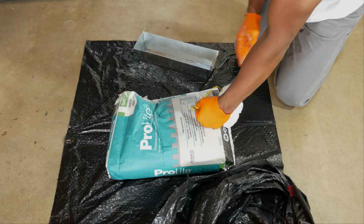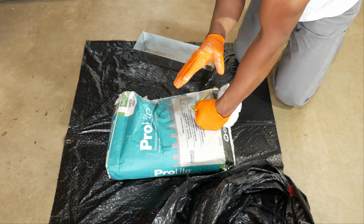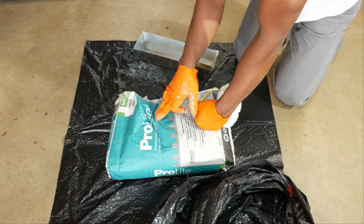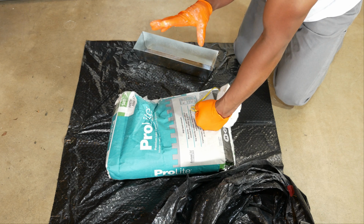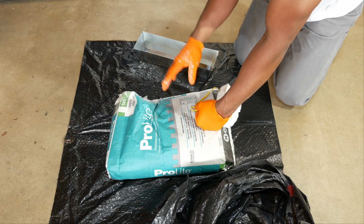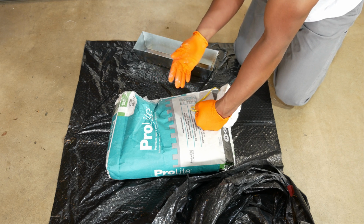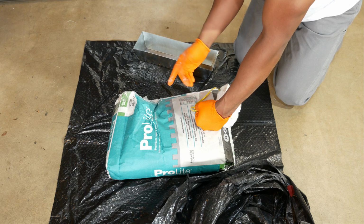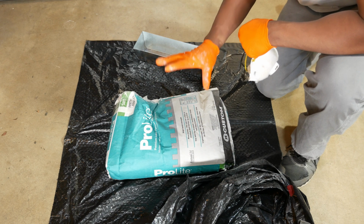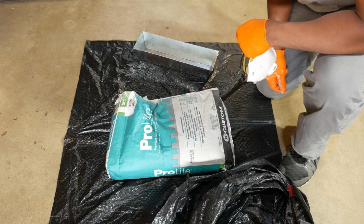Alright, so I'm out here in the garage. I'm mixing up some thin set now. In the previous video I talked about this thin set. This is Pro Light by Custom Building Products, and it is a very versatile thin set. You can use it with ceramic, porcelain, stone, glass, large format tile. You can see right here, premium large format, but it's very versatile. So I don't need much of it. I'm going to guess probably less than a pound maybe.